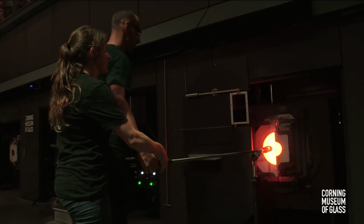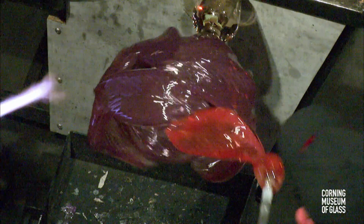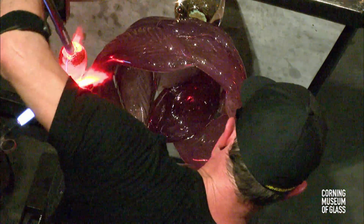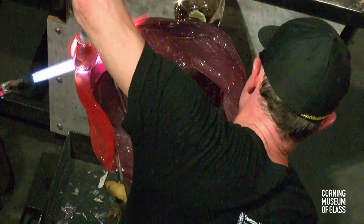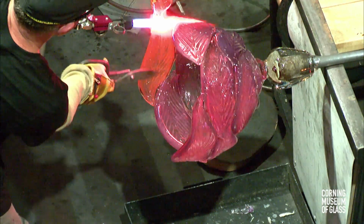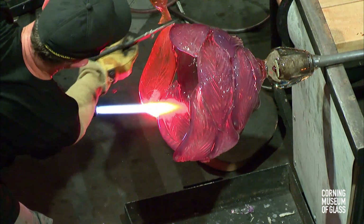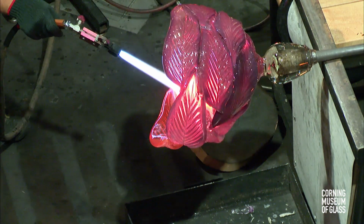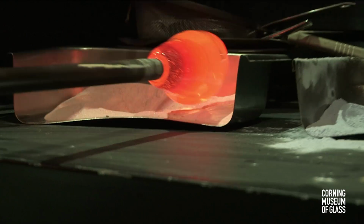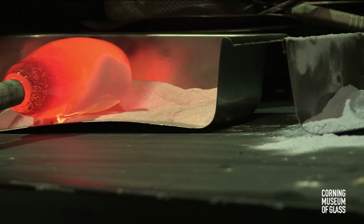Right, so how do the torches not leave soot marks? I believe that the soot on the glass is typically made just from having a flame that has a lot of gas, so it's very gas rich. It's all about having the proper balance between gas and oxygen with these torches. Even the soot that is put on the glass from time to time, if you reheat it, it burns off, and also you can wipe it off typically after the glass has cooled down.